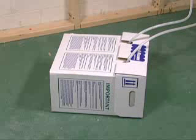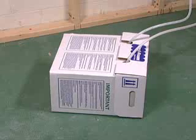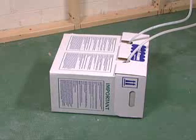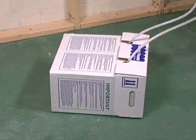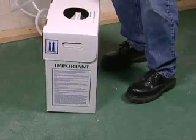If you're not getting enough pressure, the kit may have been used while lying on its side. Consider these tanks to be large aerosol cans. If you lay them on their side, the pressure will bleed through the hose, and there will not be enough pressure left to empty the tanks. There is no remedy for this. You can only prevent this situation from happening by always keeping the tanks in their upright position during use.